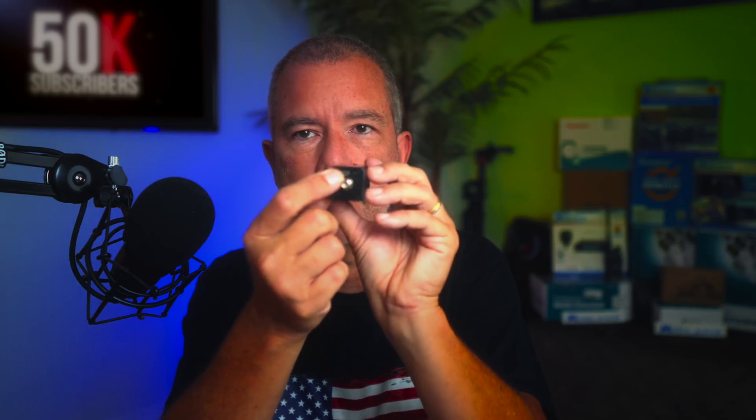This SWR and power meter works from 125 MHz up to 525 MHz, and you can measure up to 100 watts. It does need to be charged — it's got a little battery with a micro USB connector, not USB-C. It comes with a cable to charge it and a couple of adapters. You can check on Amazon to see what type of adapters it comes with, which may or may not allow you to connect it to your particular radio, so look to see what it comes with because you may need additional adapters. It also comes with a 5-watt dummy load, which you connect for testing power output of radios — but this is only good up to 5 watts. The meter can check up to 100 watts, but you can only test up to 5 watts with the included dummy load.